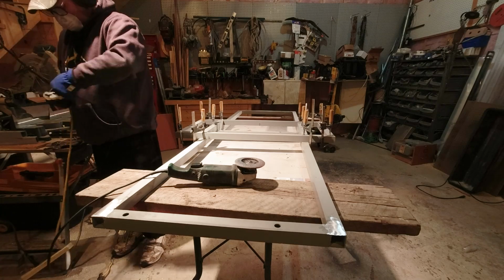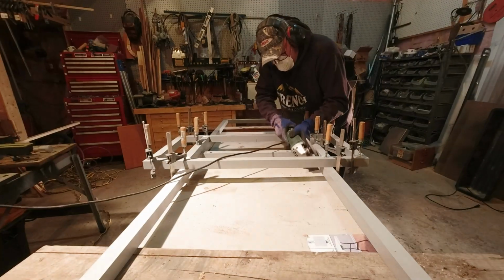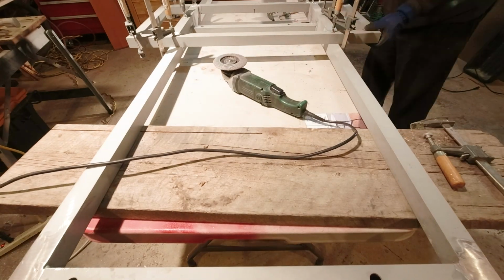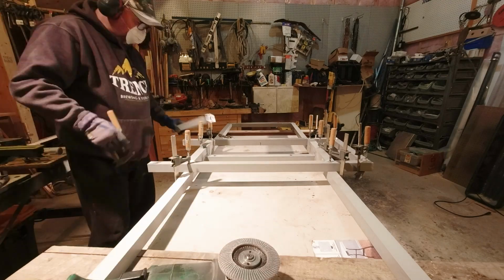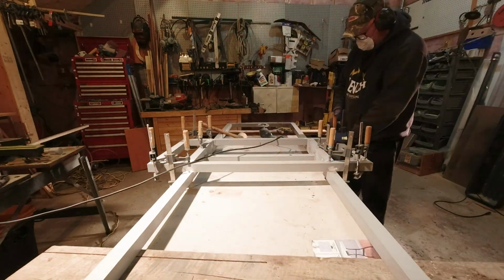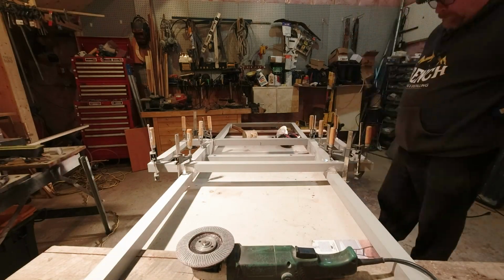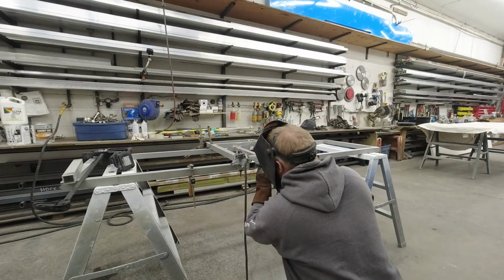As I talk about a little later, welding aluminum is very precarious. It needs to be immaculately cleaned. And because this was already a structure and it was powder coated, which was nice because it has an undercoat for me, I still have to clean off all the connections and all the powder coat now that I know where I will be welding these together. So I have to make sure they're incredibly clean and all the paint removed. When I get on site, I will use a gun wash or some sort of denatured alcohol to remove any of the acids from my fingers or any of the contaminations or oxidization it's gained over the 12 hours from this point, when I take it to the shop to actually do some welding. So one word of caution, it needs to be ultimately clean before you can start welding.